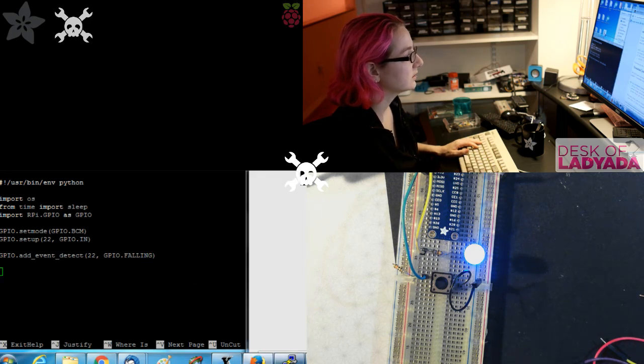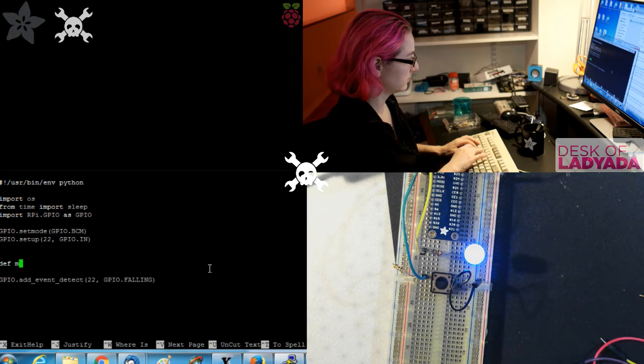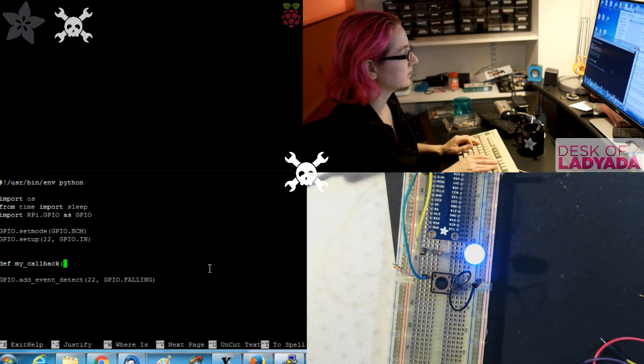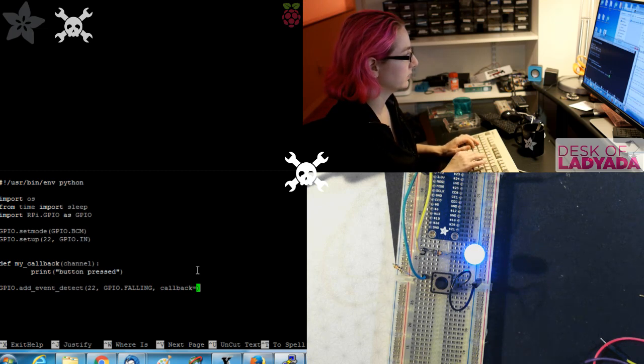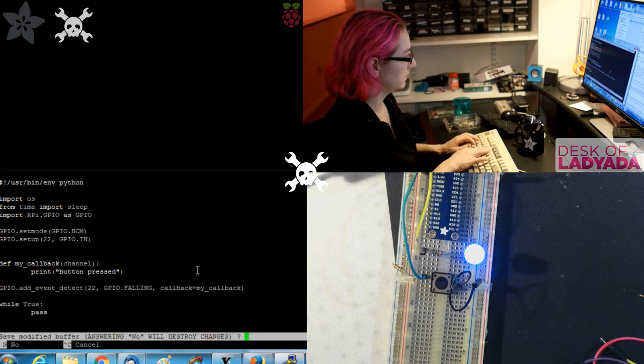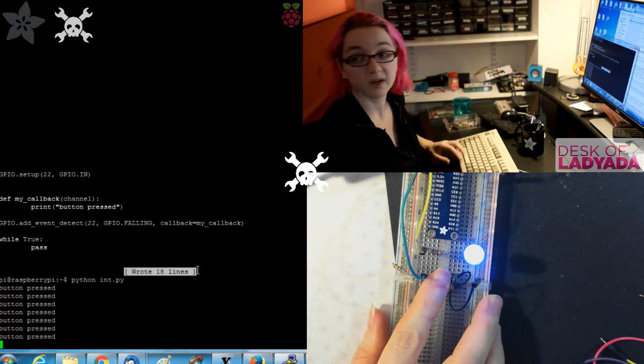And then I guess that's not really a callback. Oh, I can set a callback. So GPIO falling, and then callback equals my callback. And then okay. I don't know, let's try this. Yeah, so you can do interrupts that way. Seems to work just fine.